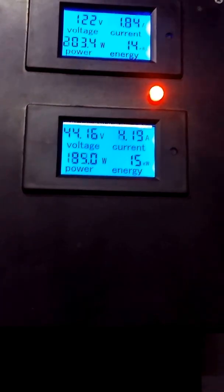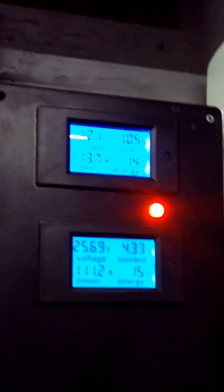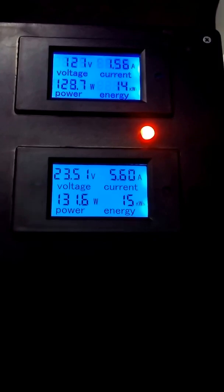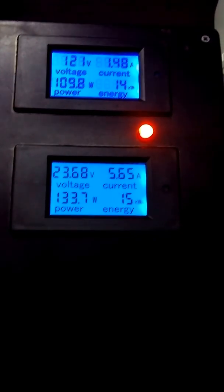This system switches at 10 miles an hour. It's good for up to 100 volts DC and up to 100 amps DC. However, because we're grid-tied, I only wired it for 30 amps — because by the time you get up to 50 volts at 30 amps, that's 1,500 watts, and this turbine can only do at most 1,500 watts. So it's going to be very hard to max out that wiring. It's all stranded single-conductor wire — basically like welding wire, very flexible.